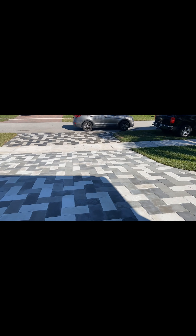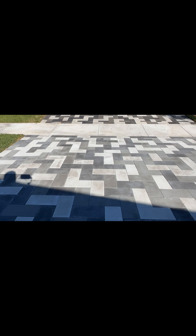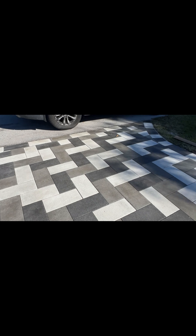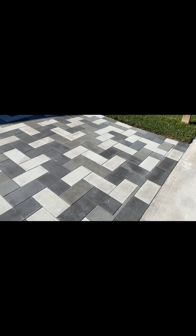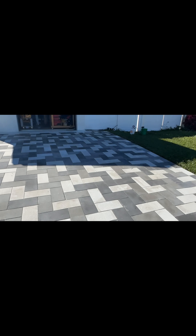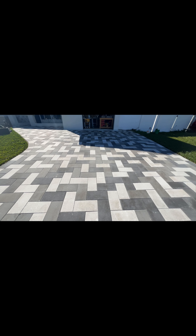Here's the driveway — I've been cleaning it all day. Some spots are still a little wet. I did apply a fresh first coat of sealer. You can tell there's a little bit of splotchiness — I need to get the spray pattern a little better on my sprayer. But once I go over with the soaking second coat, it'll all be nice. You can tell the difference between the sealed and unsealed sections. I've got my pump sprayer set up — putting in two gallons, should cover this area. The product says a thousand square feet for five gallons.